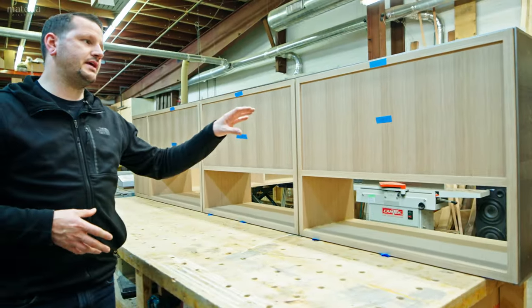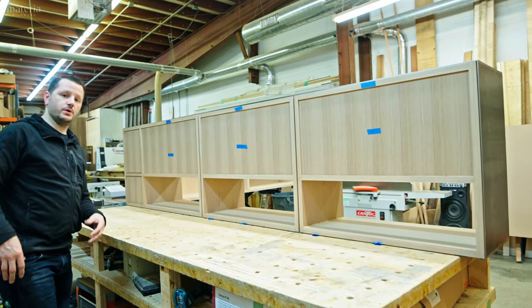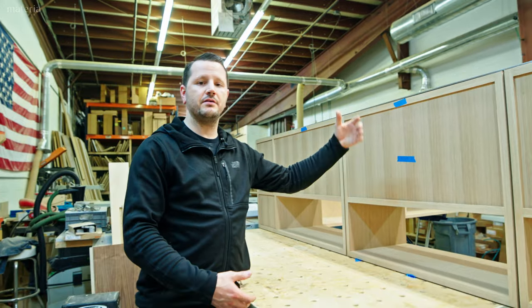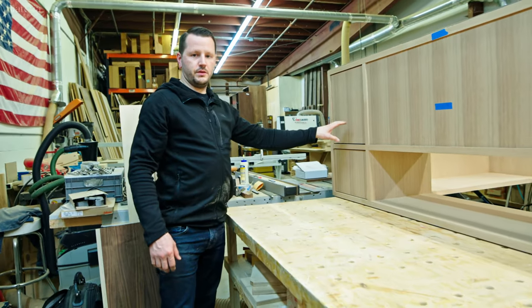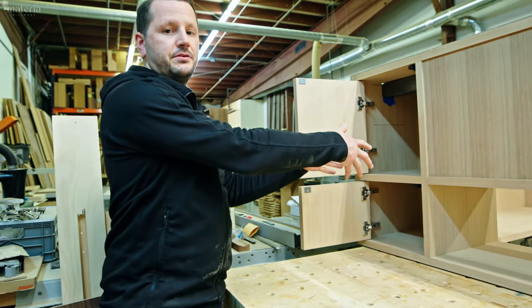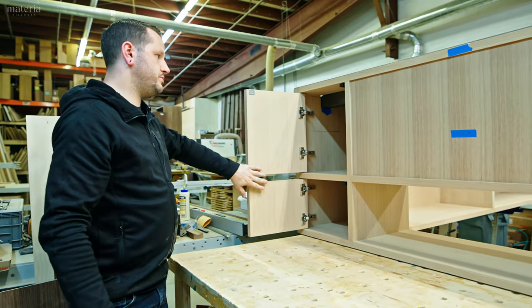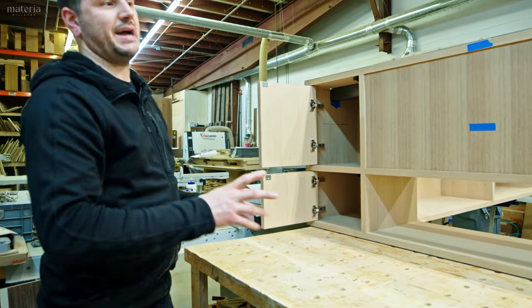This suspended cabinet is visible from three sides — this here being the backside, with a dining room going right where I'm standing now. Below here is going to be additional cabinetry on the backside of that kitchen peninsula. These panels are all just fixed panels so that you have interior storage space on the working side of the kitchen, with open cabinets on the bottom and two additional cubbies on the end. On the backside, that's where the uppers on the range wall will be, so these will only be accessible from the dining room side. We're using touch latches on this side — no hardware — giving us a nice clean look across this entire back space.